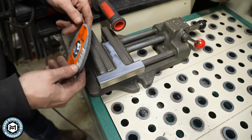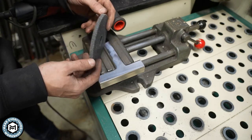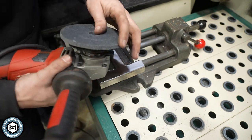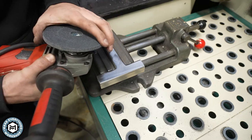The difference I'm going to use on the stainless is one of these uniform surface finishing discs. This one specifically is designed for stainless and it's a soft pad. We're going to run it at a slow speed and this is going to bring our finish up to an even finer grind before we go to polish.